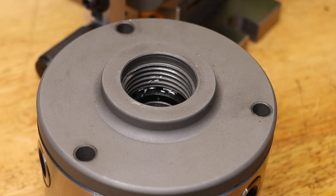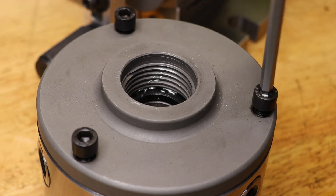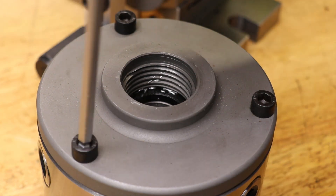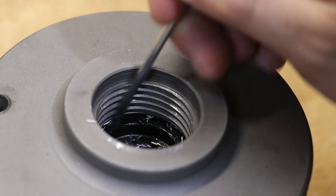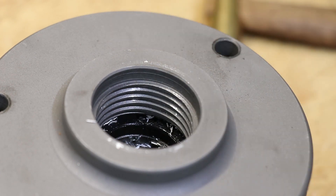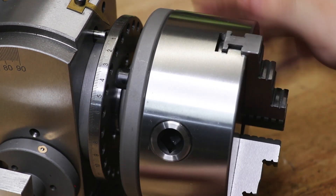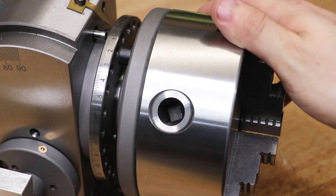The final thing I'll talk about is the chuck and backplate. It's on so tightly that I couldn't separate them — I imagine the register fit was made very tight, and they likely used the screws to pull the chuck onto the backplate and seat it pretty much permanently. I could use heat to loosen it, but there are plastic parts on the chuck I'd rather not melt. What I've seen others do is drill through the backplate, tap the holes, and use screws to jack the backplate away from the chuck. That might be on the agenda one day, but it's not a huge priority — the chuck works fine and I can't feel any grit I'd want to remove.